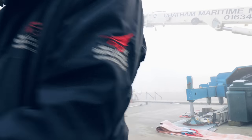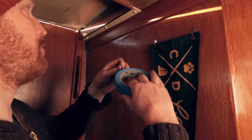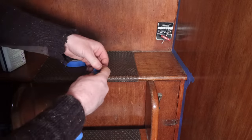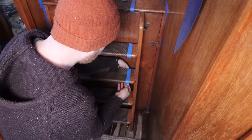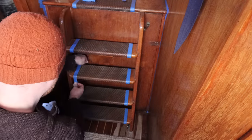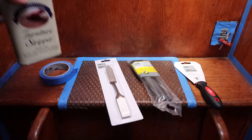Let's see if we can do this — it's back to Kadoa. Pour all the liquid into a pot, brush it on liberally, leave for 15 to 30 minutes to allow the stripper to penetrate, then remove. You may have to repeat this step two to four times to get all the varnish off — so let's see how we go.